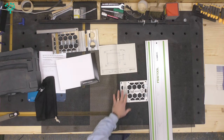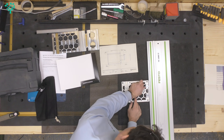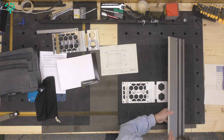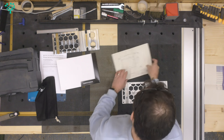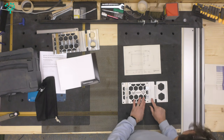When you put your track onto the rail square and slide it on, turning the thumb screws moves the rail - deliberately putting it out of kilter, you can see it move. What's happening is the thumb screws are pushing that edge of the track against the square, and if that angle is not square, it would not clamp down square. That's the key angle that makes repeatable squareness. On mine, the tolerance came out at 90.003 degrees on one end and 90.001 degrees on the other - pretty bang on 90 degrees.